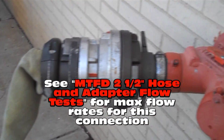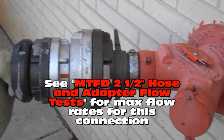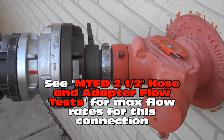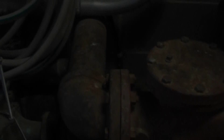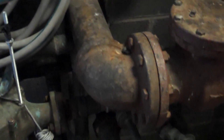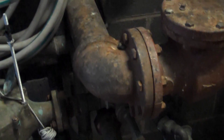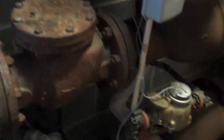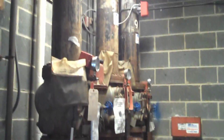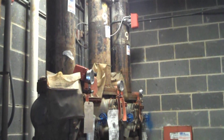That is a four-to-five, five-to-two-and-a-half female to double male Siamese. Interior of the standpipe, I have what appears to be about a four-inch line going to a capped riser, and then three, I believe, eight-inch risers.